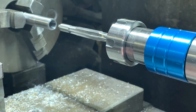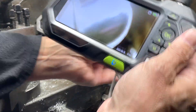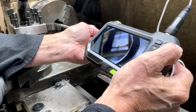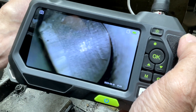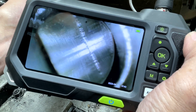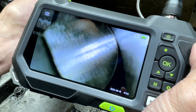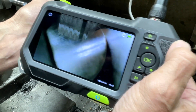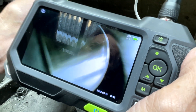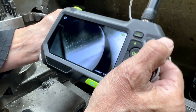If we use our bore camera and slide back the tailstock, we'll get the bore camera in there. You can see the twist drill has cut the hole down inside the steel and it's got a very poor finish. Then we come back to where the reamer has cut the chamber and it's got a much much better finish, but there are still some little marks in there up and down which we can see.